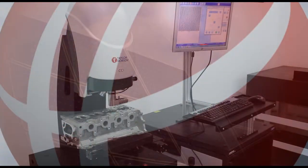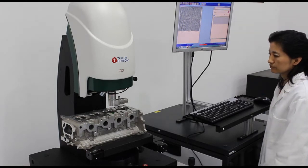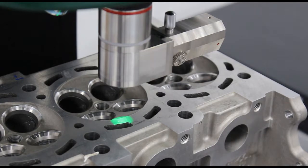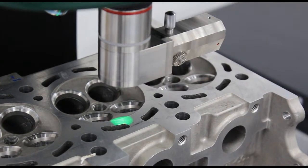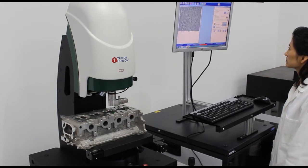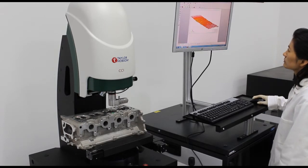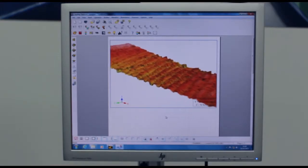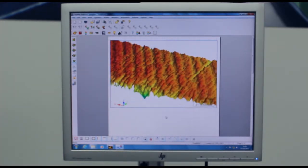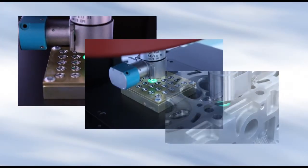Options such as CCI Roundness offer automatic high-speed non-contact measurement of fuel injector cone angle and roundness, providing new and exciting application possibilities. CCI Roundness offers advanced 3D non-contact measurement and analysis of cones, with fully automated 3D measurement analysis of the whole seat contact region, delivering cone angle, roundness, roughness and straightness results from the same 3D dataset. For this type of application, the CCI can replace multiple stylus instruments such as traditional roundness and surface finish systems.